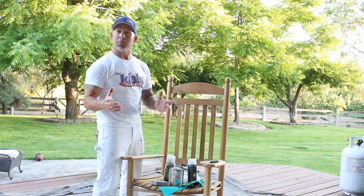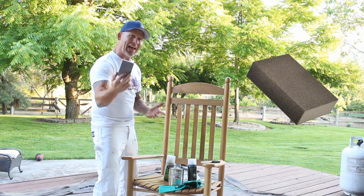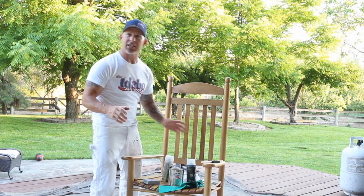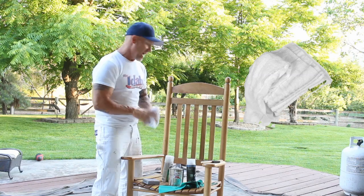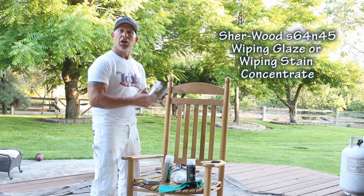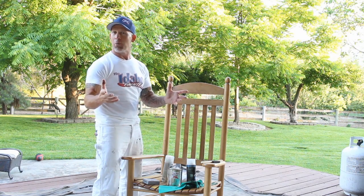I gathered all my tools up for this project — you can get them all at your local paint store. You're going to need a foam paint brush to apply your glaze with, some rubber gloves to keep the glaze off your hands, a medium-grit sanding sponge, a spray can of lacquer, and a spray can of Helmsman Spar Urethane — I like water-based, which is an exterior product usable interior and exterior. Make sure if your project is going outside that you use an exterior clear coat on your final finish. You'll also need some rags, and lastly a wiping glaze from Sherwin-Williams. Wiping glaze, stain, and gel stain are all different things — you want a wiping glaze specifically to achieve this look.